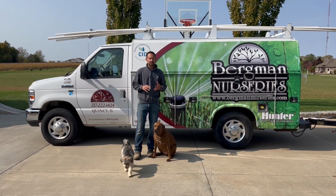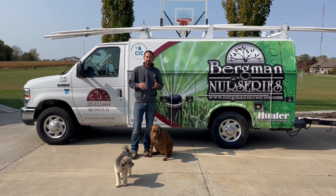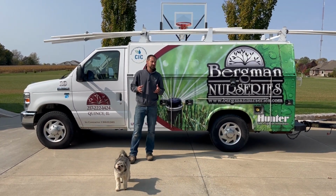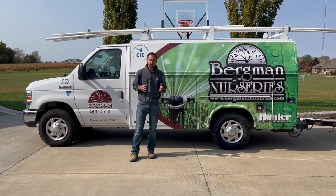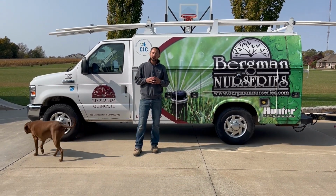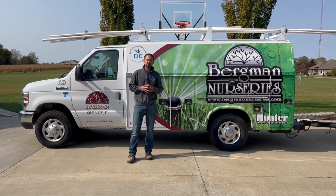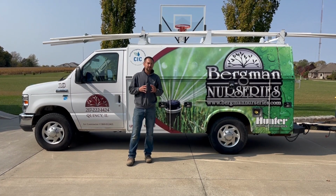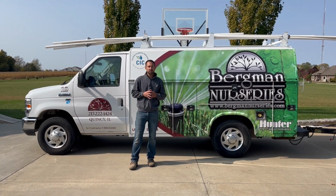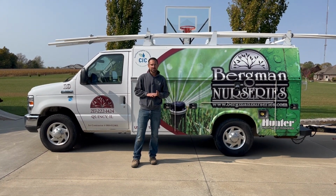And if you've got questions, I understand it's not something you do every day. Give us a call. We'll do the best we can. Unfortunately, this is happening earlier in the season than it ever has. I think the record low temperature is back in the 40s or something, so we're very unseasonably cool for a couple days here. We've got 400 some customers, and I can't get to everybody. We do have 4 compressors out running trying to blow things out. But ultimately, the backflow is the homeowner's responsibility. We're going to do everything we can to help you so you don't have issues, but it is your responsibility to take care of the backflow until we get there to actually winterize the system.